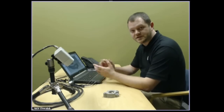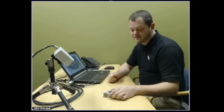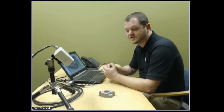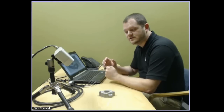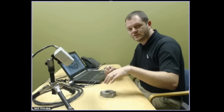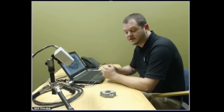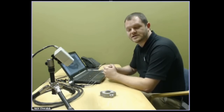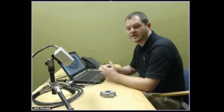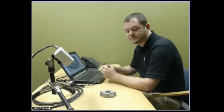There's a great question: does the surface need to be prepared before scanning? You can see this is a cast aluminum part, so this doesn't need to be prepared. But if it's shiny black or translucent, it's generally a good idea to spray it with some sort of powder. That will knock down the shine and make the image that the cameras see easier to read. Every single structured light scanner on the market will require some sort of preparation. We recommend developer spray - that works well. A lot of times in the field, we'll stop by a store and pick up foot powder - that's a great substitute and you generally don't need an MSDS for that.